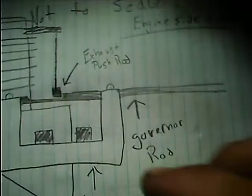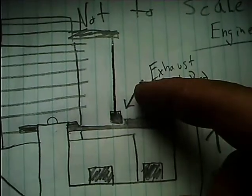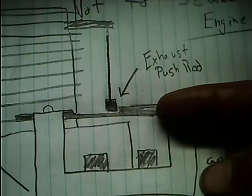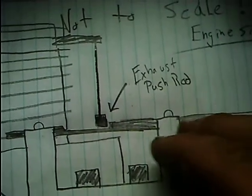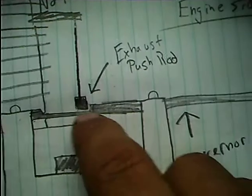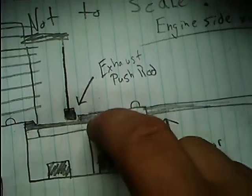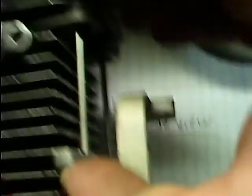When the engine comes up to speed, the governor will push this piece of keystock forward. At the time when the exhaust valve is raised on the exhaust stroke, with the pressure from the governor, this piece of keystock will slide under the latch-out finger and, because it'll have a notch on it, it'll raise it up — probably around a quarter of an inch. The exhaust valve has about a quarter inch of total travel from fully closed to fully open.